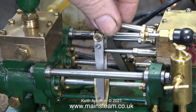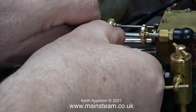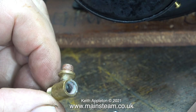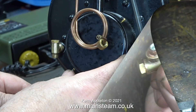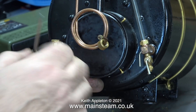I fitted new o-rings to the valve glands and here I'm tightening the nuts to hold the parts in place. I'm going to fire up the boiler and give the engine a steam test, but first I'm changing the aluminium washers on the check valves. This boiler is not very old but there is some corrosion already. The washer on the bench is a shim washer so the check valve ends up in the right place. Here I'm applying some Loctite 542, and now I've refitted it to the back head.